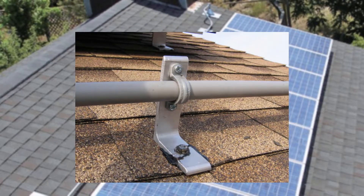Holy crap — then I saw an example like this and I just wanted to share the fact that this is being installed by somebody. This is obviously a do-it-yourselfer, so it's something I would never expect you to do, but I just wanted to show you that some people think this is okay. They just got an L-bracket from Home Depot probably, drilled a pilot hole, put some goop in there, and bolted the thing down onto comp shingle and figured that's going to hold it. Pretty bad.